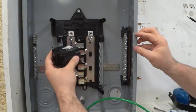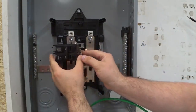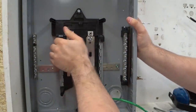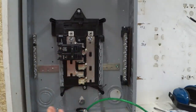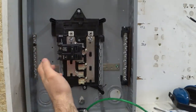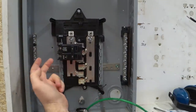Now this is a Murray panel. We put this in by hooking one side of the circuit breakers and then pushing onto the bus bars here. Now this is called backfeeding — we're backfeeding this breaker. When the inverters backfeed on this side, the wires themselves will be live, so just switching this on and off doesn't kill the wires themselves.